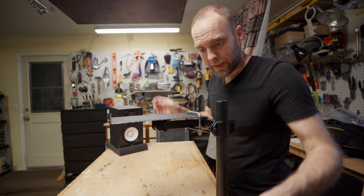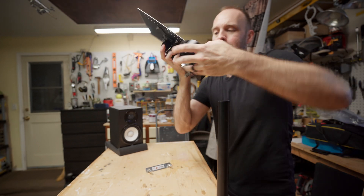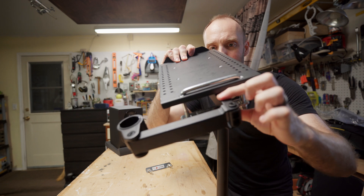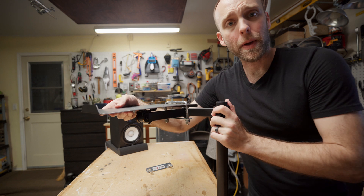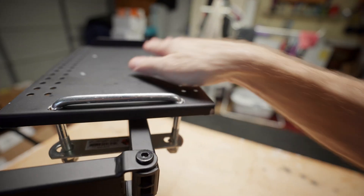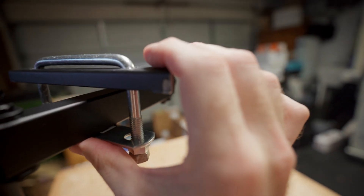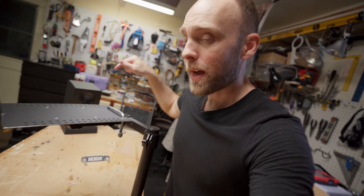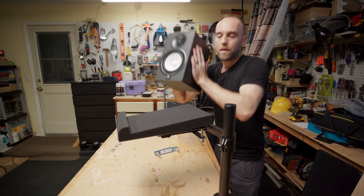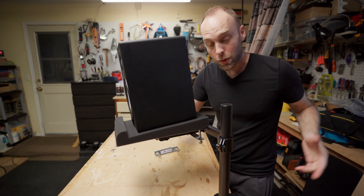After some final testing, this is what I came up with. I got a U-bolt — a squared-off U-bolt. I took the plate and drilled two holes in the back and ran that U-bolt through it. It basically just grabs that bar. You can see that this U-bolt grabs that and there's no way for the front of that to tilt down. The speaker front goes up there and it can't tilt down because if it tries to, this U-bolt just rests right against the bottom and that's not going anywhere. The speaker at a slightly higher angle with the foam pad on will be nice and safe — that's not tilting forward.